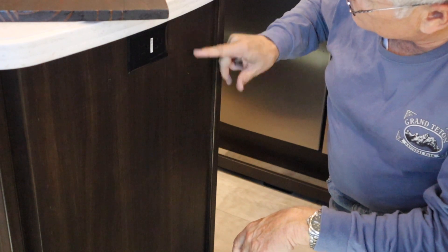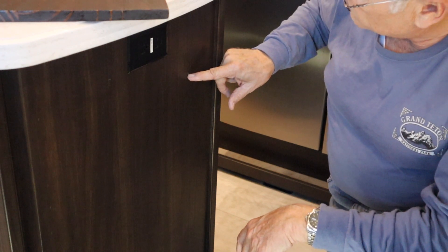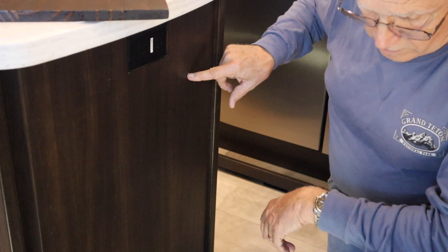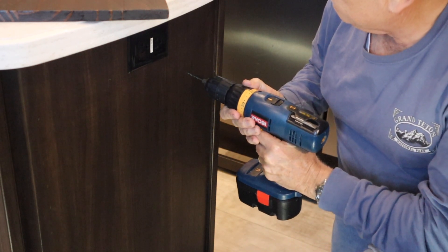We've located our pilot hole: it's going to be 6 inches from the top of the cabinet and 3 and 9/16 inches from the side molding — that's where our first bolt is going to be, so we'll drill the pilot hole right there. We're only going to measure the first one; the second one we'll position by fitting. We'll get the shelf up with one bolt, get it level, then mark where the next bolt has to be. That keeps us from putting holes where we don't want them — experience talking there.